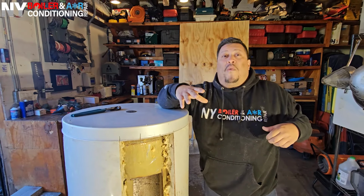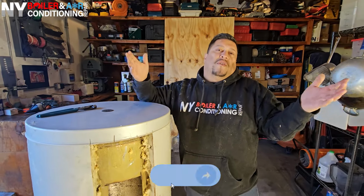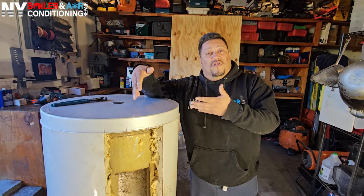So guys, that right away triggered me. I said, listen, you have a bad indirect hot water heater. And of course, some customers are going to be complaining: oh my God, it's so much money, what am I going to do? Are you sure? I am sure. Because in this particular case, you can only get water two ways. You only get it through the pressure reducing valve, or you have a leaking internal coil.